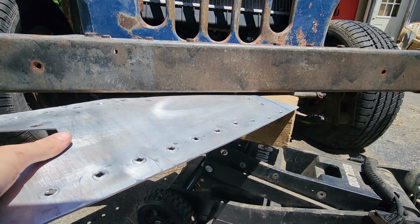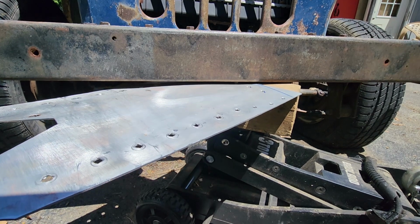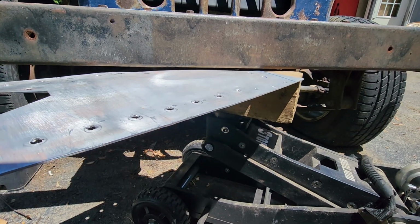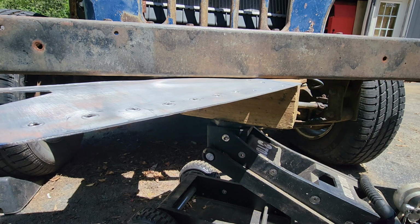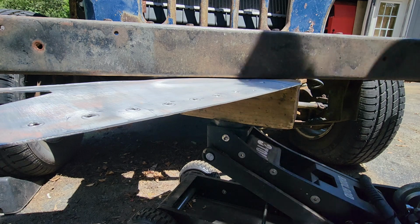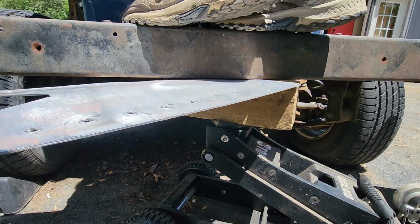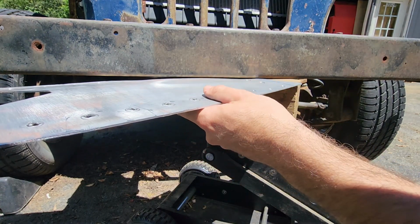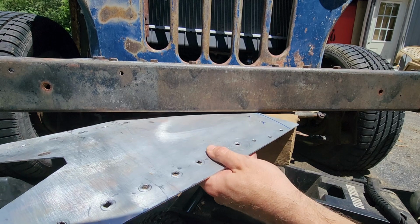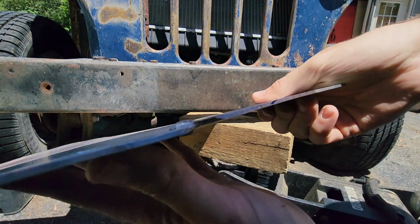Lift your jack up, put a little bit of pressure on your die, and my press won't apply enough force all by itself, even if you have both the tires of your press off the ground. So you got to weigh about 220 pounds, get on the bumper, and give it one good jump, and that ought to send her home. Take a look here. Oh yeah, isn't that about perfect?